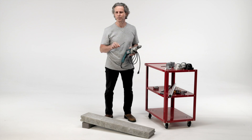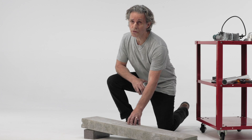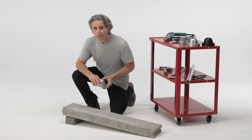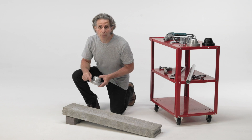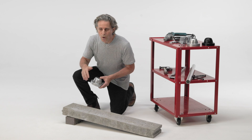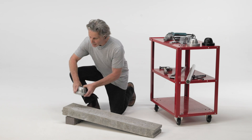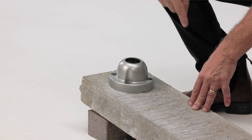This one's 3/8 inch in diameter to match the 3/8 inch diameter of the anchor bolts we're about to install. The first thing to do is measure exactly where you want to place the posts. I like to use a pilot drill — a smaller masonry drill — to drill the holes first and then finish off with the full size drill so it doesn't wander too much. Another trick is to install one of the anchors and then bolt your base down and use the post base itself as a guide for the other three holes.